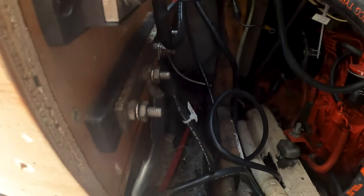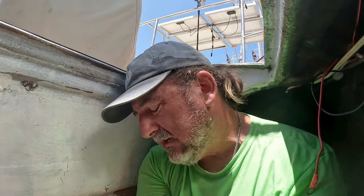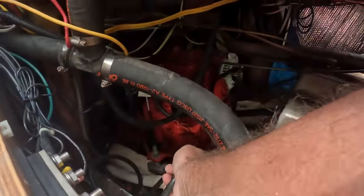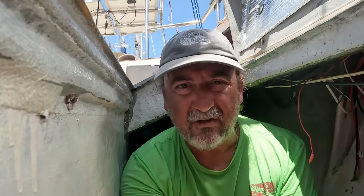What I've added is two buses — the lower bus was already here, and I've added a secondary house bus. Rather than having to trace down and lengthen every one of those wires, I've separated it into two buses, which still accomplishes the mission of separating the house from the starter. Then we'll tie those in with the main bus bars using a big four-gauge cable. Only one mystery left — coming off the bottom is a large cable that appears to go to the engine block, so I'm going to check the book and verify, but I'm pretty certain that's an engine ground.